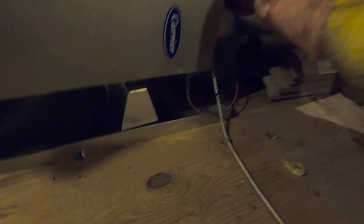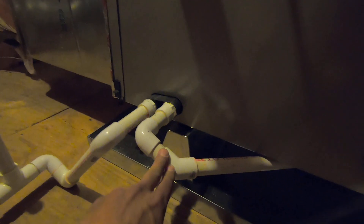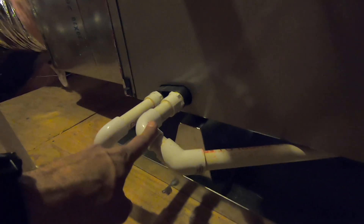The other thing you have to do on a fan coil is handle drainage. It sits on two stands. We have a primary and a secondary drain line — the primary runs out that way down to a bathroom drain, and the secondary runs over a window. Then we have a third fail-safe, which is the condensate pan that runs the full length of the fan coil. On the end we put a kill switch, so if any water hits that pan, it will kill the system.